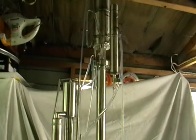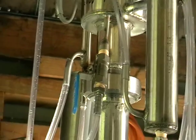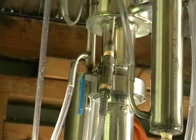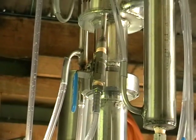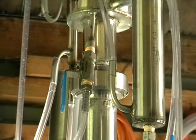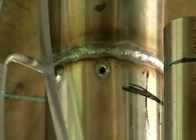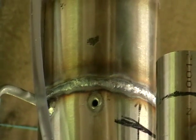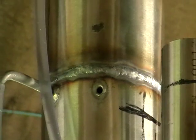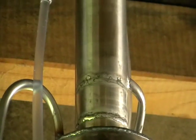Here's the controls. Here's the water control for the heads control — if you don't like the amount of heads and want to remove more, just add a bit more water and you're going to get more heads removed. Here's an optional slot for a thermocouple for electronic temperature control, just for observation. Here we've got the top section for heads removal and condensation.